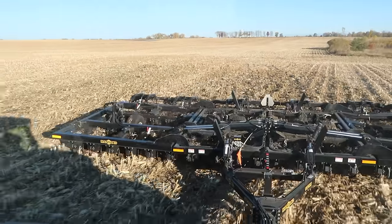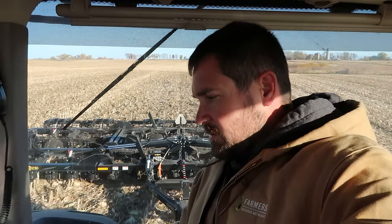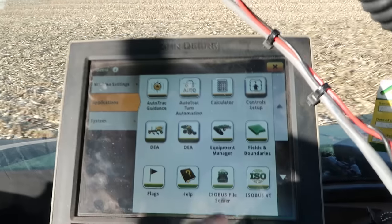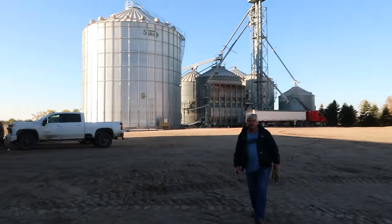I went a little bit deeper with it here. The key to this thing is speed — it likes speed. And I can see my working width is off so I'm gonna have to adjust that. Sounds like Onyx is ready to run some combines so I'm kind of out of time with this thing right now. It needs DEF and one of the Harrow sections must have got bumped with something — it's way out of adjustment and I can't get it free. It's gonna need a hammer. It's got a Harrow in front of the basket with an adjustment lever on it and I can't move it.